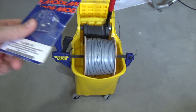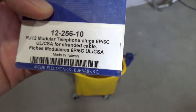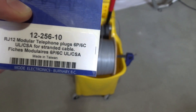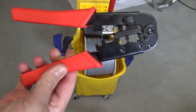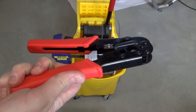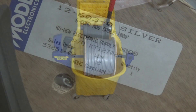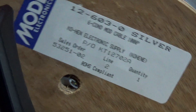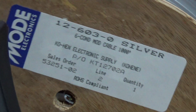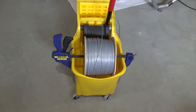You'll also need RJ12 telephone plugs — just make sure they're six-pin, six-conductor. The last thing you need is a crimping tool. If you're a model railroader doing DCC, it's totally worth owning a set of these. The wire I use is labeled 'six conductor modular cable' made by Mode Electronics.